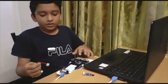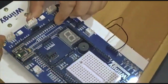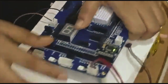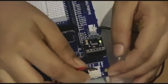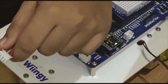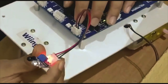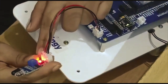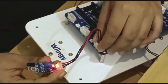Now let's take our 3-pin JST connector and plug it in. Here it is written VCC, GND, and OUT, and also 1_IR. Now let's take the other end and connect it to our IR sensor, making sure that the VCC on the VIN Board is connected to the VCC on the IR sensor, and likewise for the GND and OUT pins.